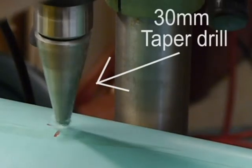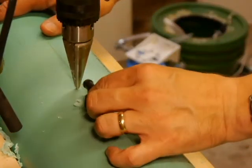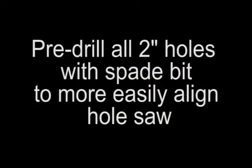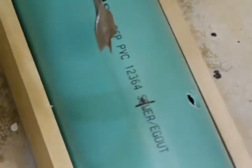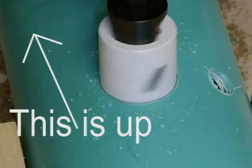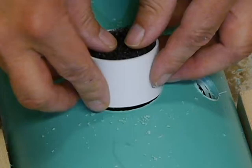The taper drill is especially good for drilling plastic, and the test tee can be used to check a snug fit on the holes as they're being drilled. You can use a spade bit, which has a nice point that doesn't walk, in order to pre-drill the holes so that it's easier to drill the larger holes. When drilling plastic with a hole saw, it helps to put the drill in reverse. If you try drilling in the forward direction it will grab the plastic, but in reverse it slowly wears it away and it's much easier to cut.